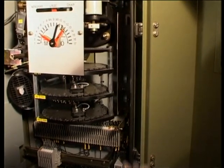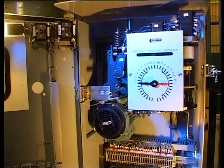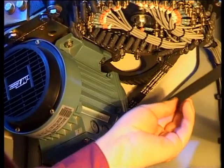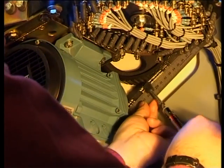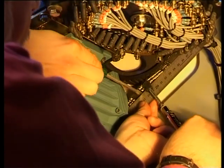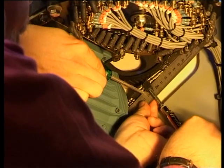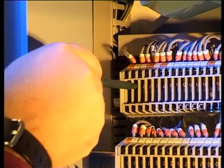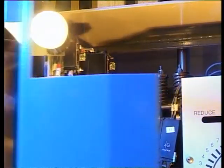Check that the element is working. Check that the drive belt tension is sufficient. A load of 10 newtons should press the belt in 5 millimeters. Disconnect one of the phase wires and check the operating time of the motor protection by doing a raise or lower operation.